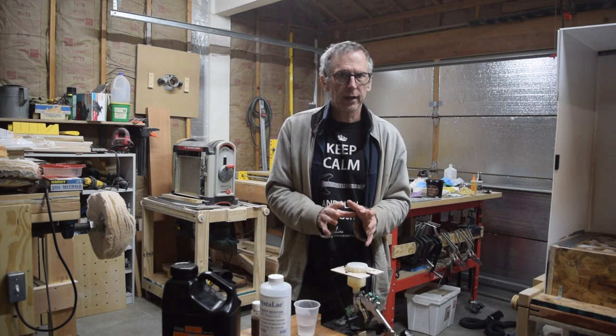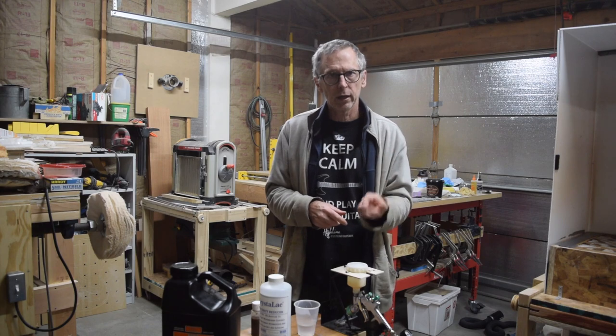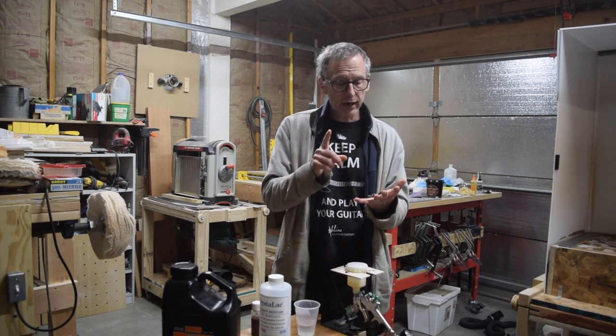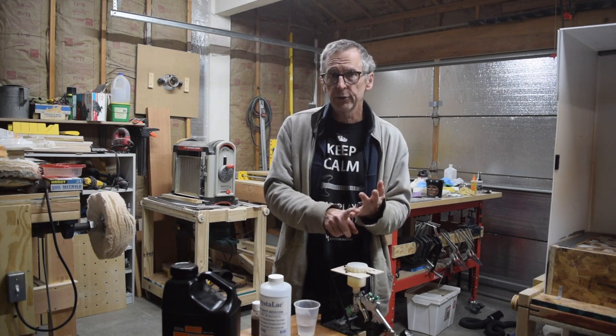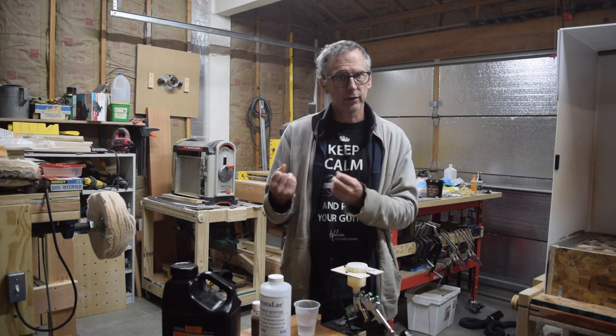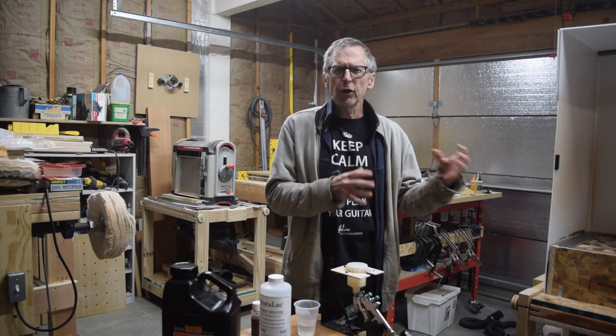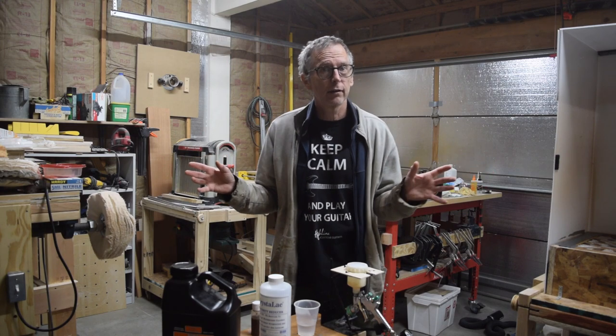With that in mind, let's look at the type of spray gun I'd recommend. There are two terms to be aware of when selecting spray guns: HVLP, which stands for high volume low pressure, and LVLP, which stands for low volume low pressure. HVLP especially is the most common type on the market today. There are still a lot of general purpose guns out there, but those aren't going to work with the compressor I recommended, so you don't need to consider those.